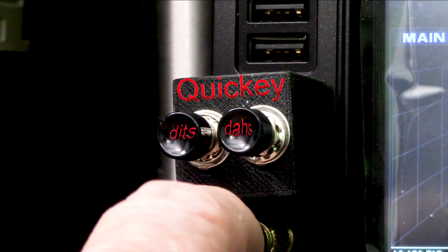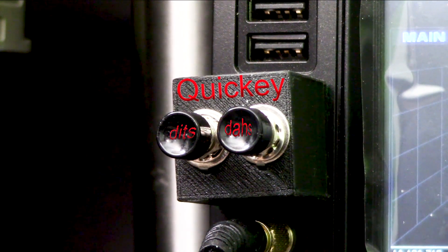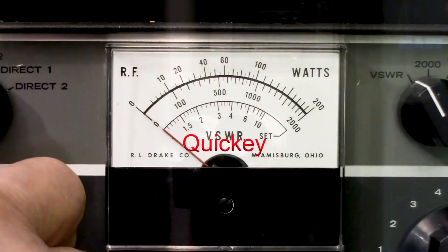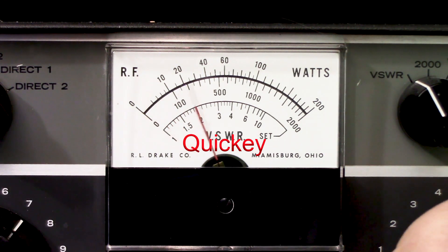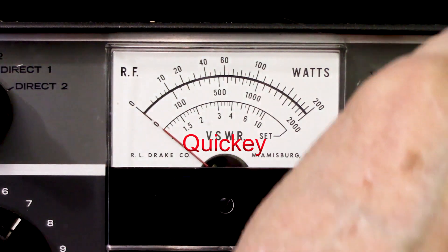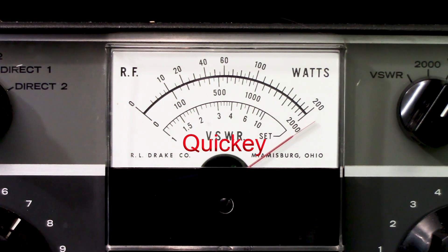From here it's going to go into a small amplifier, KPA500, set for about 200 watts output. We're going to see what it shows on a Drake wattmeter built into the Drake MN2000. The Drake wattmeters are heavily damped — that is to say they're slow. I'm going to tune out the little bit of SWR that there is. That's pretty close. So I've got about a one-to-one SWR. Put the switch into the 200 watt position and I'm going to key the transmitter first for 200 watts. I'll dial down the drive just a bit — otherwise I'm going to bend that needle.